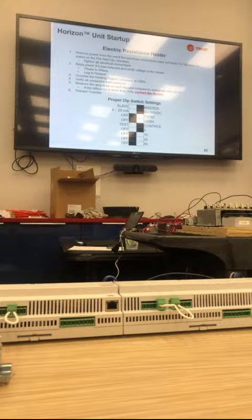Electric heat, real quick. We don't have the power to test auto electric heat at full capacity. We turn it on, make sure all the contactors pull in, but some of the heaters that we get ordered are 179 kW, 208 volt. So they're 400, 450 amps, 500 amps. We can't test them all. So what we ask of you guys is, one, check all the connections first before you start them. We should be doing that here, but do it also after transport. You want to check phase to phase, leg to ground, and override the heating output command to 100. If your amp draw is 10% over or under the nameplate, give us a call because there's an issue. You should be within 10% or less. If not, we will have to troubleshoot it with the wiring diagram.